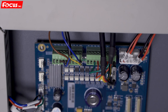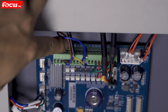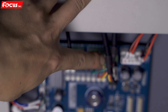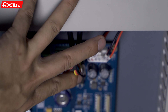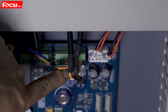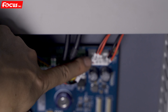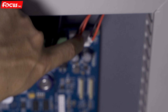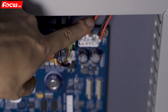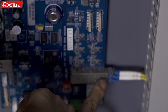When we look at the main board, we can see several cables connected to it. From the top, there is the UV lamp signal cable, and here is the ink pump cable. The 24V ground lines are combined together, with connections for different ink pumps for each color. Here is the power supply plug: 42V minus, 42V plus, 24V minus, and 24V plus.